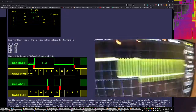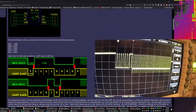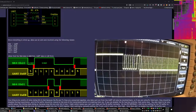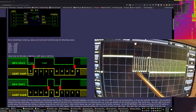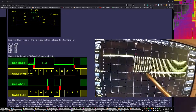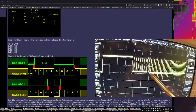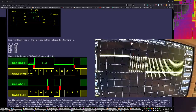Okay. And suddenly, I should have left this over here, suddenly we start to see bits from the controller itself. So if we zoom around a little bit, then we can see that that was still in that position where the command from the console would be, in this case, these bits here. That's the command string, these 8 bits, and then we should see 4 more bytes after that of data.